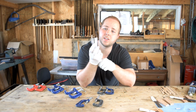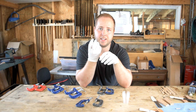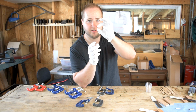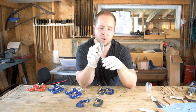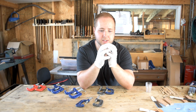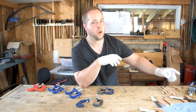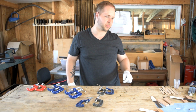Now I will say, watch it with epoxy, because with a two-part epoxy, when those chemicals mix, it generates heat, and that heat is what helps it cure quickly. So if you mix it out on a piece of cardboard, you don't have much volume confined in an area, so it's spread out, and it takes a lot longer for it to set. When it's in a cup like this, the volume is compressed, so there's more sitting together, and that means it generates a lot more heat and it'll cure a lot quicker. You'll notice if you're holding this cup while you're mixing it up, you'll feel the heat in your hand. So just something to think about. You don't want to mix a lot, just enough for one knife in one of these cups, because you'll never get the knife put together before the epoxy is set up and you can't spread it anymore.